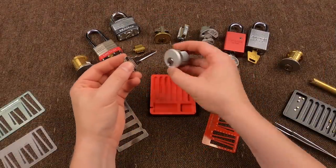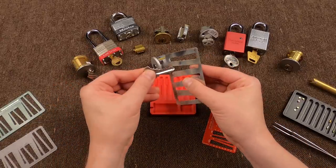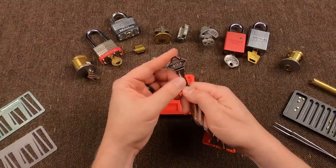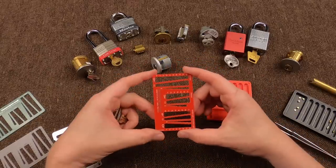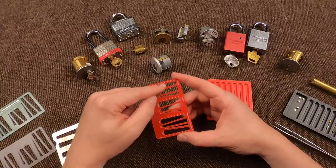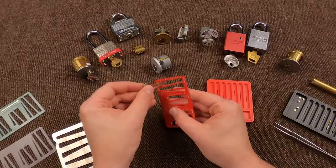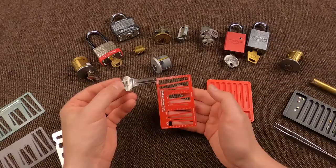So let's say you're on a job site and you find a key. If you had the original lab card, you could decode that key. Let's go ahead with Schlage — what do we got? Three, two, two, three, two. Really, really good bitting on that. What would you do on the devious gauge card? We see Schlage right up here. These top tracks all relate to Schlage — the key track represents where you would decode the key. What do we got? Three, two, two, three, two. Amazing. Same exact thing.